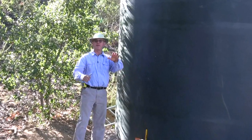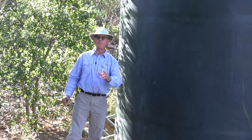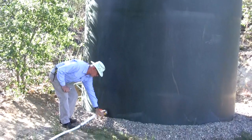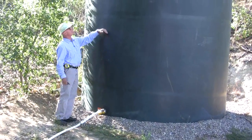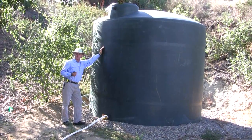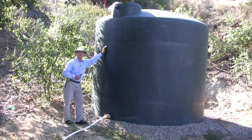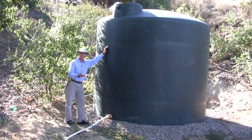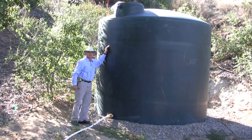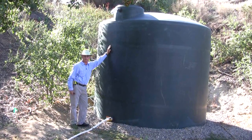Since there's only 4,500 gallons of storage down there in my surge tanks, when those get full I pump it up the hill through a simple garden hose into this valve — with this open, this tank fills up and I've got 5,000 gallons of surge to draw from. When sizing a system, you size for the deficit: if it doesn't rain for six months where you are, then you need six months of rainwater tank storage. This 5,000-gallon tank would last most people quite a while.